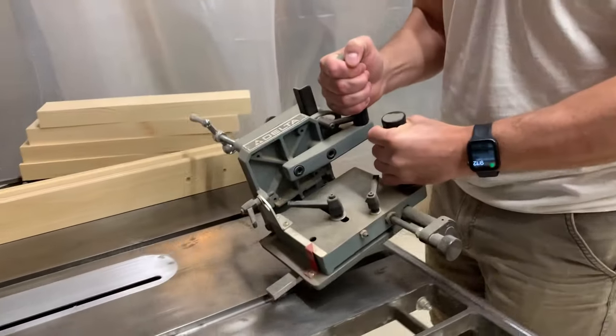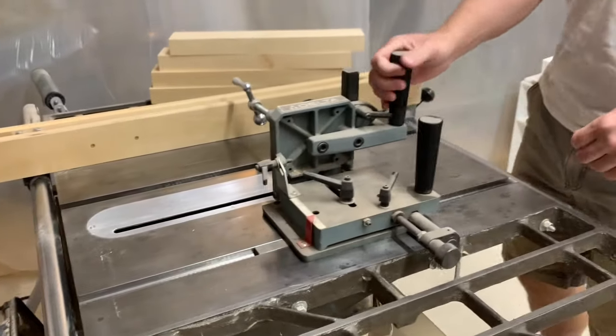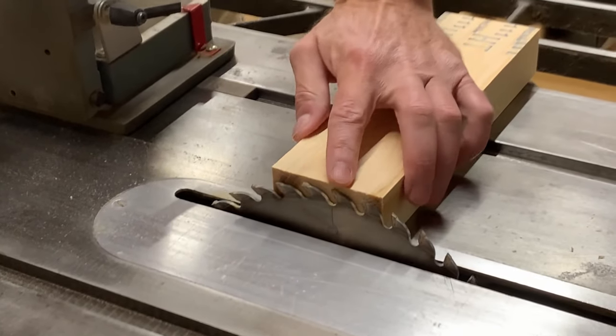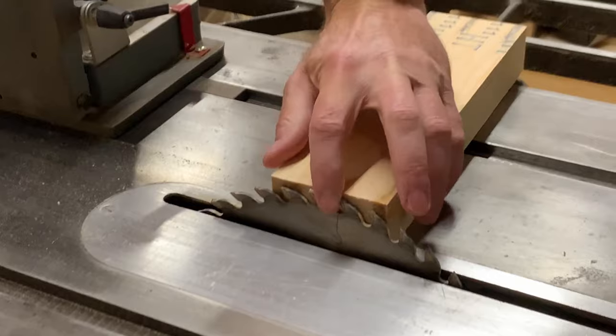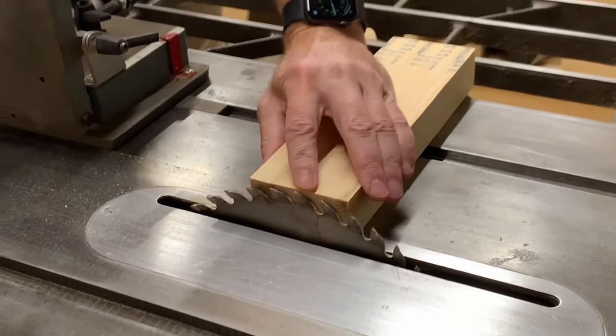I wanted a stable leg assembly, so I opted for using my tenoning jig to cut rabbets to use for lap joints. I set the saw blade to slightly less than the width of the jointed piece. I'll clean out that last extra little bit with that second cut.